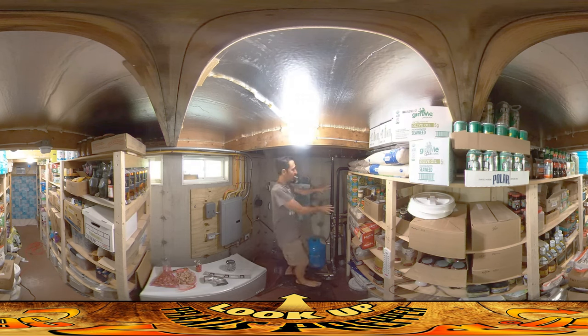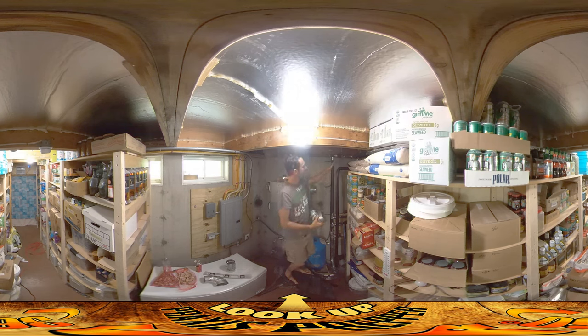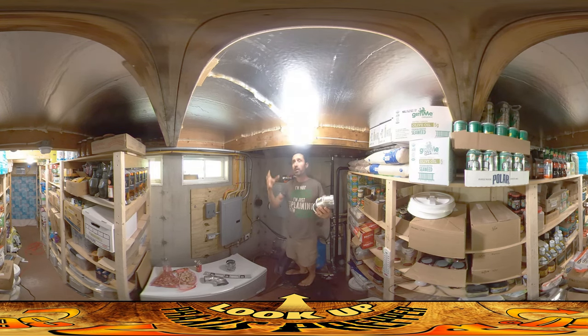The tubes that blow into the house or draw from the house are on this side. This one up here is the fresh air blowing into the house — it'll probably come out at a 45-degree angle, because whenever you can avoid a 90-degree angle that's better: you get less air resistance. So probably a 45 out of here, then another 45, and it'll run into the kitchen over there. That's where the fresh air is going to blow in. The stale air is coming from all the way up on the third floor in the storage room — that's the hottest area in the summer. So if we run this at night to get cool nighttime air in, we'll be grabbing the hottest air from the house that you don't want in the summertime.